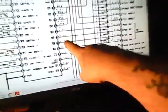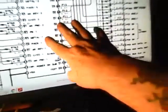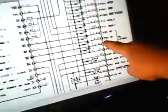Let me see if we're in the ballpark. Okay, whoa, okay. Now, like here, all these they're saying 5 volts, 5 volts, 5 volts for this chip. And you go over to the next chip, and there's more. They're all 5 volts, 5 volts, 5 volts. But if you come down here, this one is 1.3. That's a data going out, and it's only supposed to be 1.3. So let me put this back where it's supposed to be. Sorry, I didn't mean to bounce you guys around. But there we go.